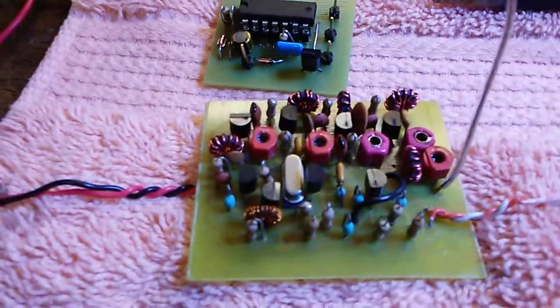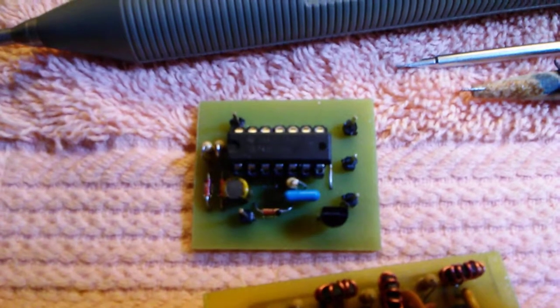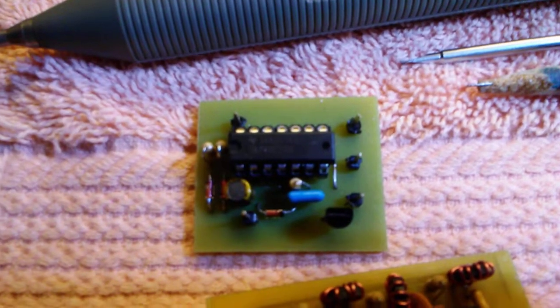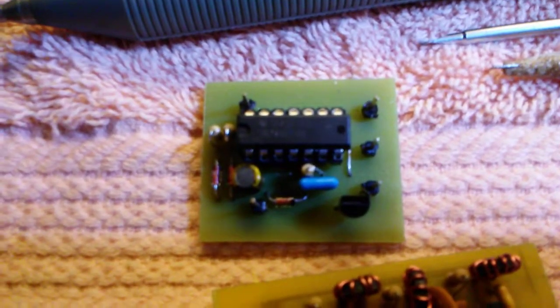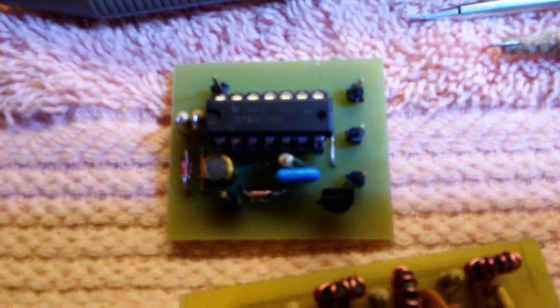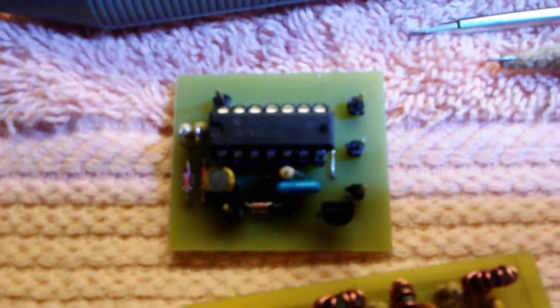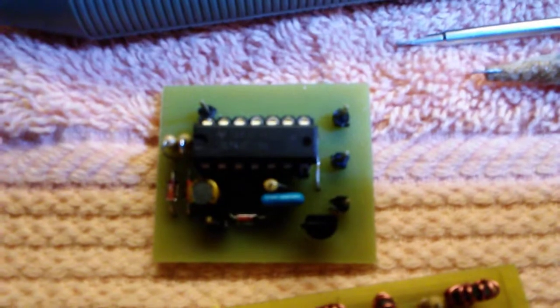What I'm going to do with this is remove the microphone preamp and add a tone generator to make it a beacon. It's going to have a pulse — a thousand Hertz tone on for two seconds, off for four seconds. I'm going to hook it to a transistor at the bottom right-hand corner of this board so that it will turn the entire transmitter on and off to save power — it's only on when there's a tone.